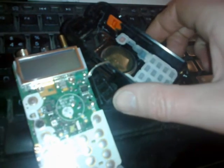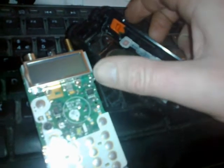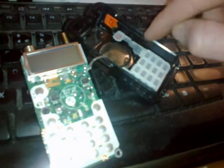The problem I had was the micro switches for the PTT, the squelch, and the radio — one, two, three — they were catching on the rubber as I was putting it back in, pushing them down so they weren't in alignment. So when I first closed it up, they weren't pushing in on the switches; the switches had pushed the rubber down.